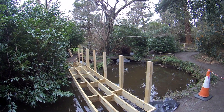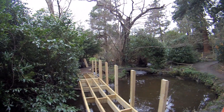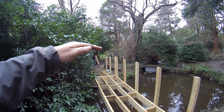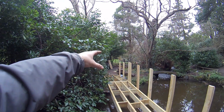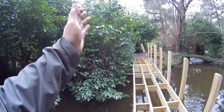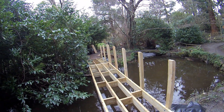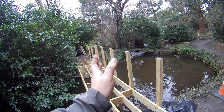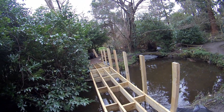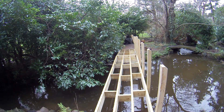I'm a little concerned about the height of the posts — I'm thinking they're too tall. I'll have to cut the ones at the end anyway because the deck is going to be sloped at the far end, so the tops of those posts will have to be sloped at the same angle. My plan is to have lunch now as it's well past lunchtime, then get the handrail posts on this side in place, get the deck down, start putting the planks on the sides, and work my way up to a height I feel comfortable with, then cut the posts again. It's irritating because I cut them all nicely, but I'd rather it be right. At the speed this is going I don't think I'll be finished today, but we'll see.